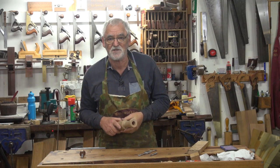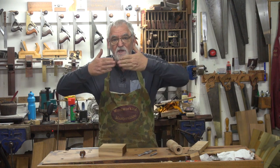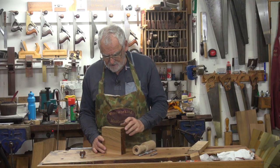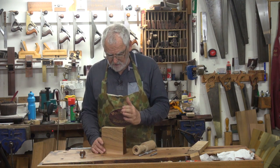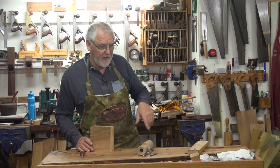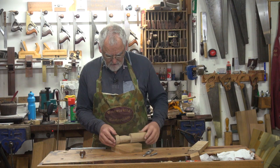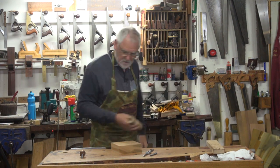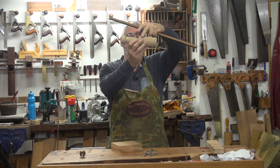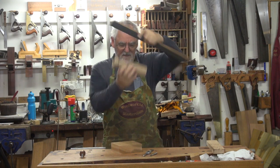It's cylindrical, so we need to make a jig. I've got an off-cut from the B boxes I make and I want to put a V-channel — 45 degrees either side — to give a 90 degree seat so the cylinder can sit in nicely. I could use a framer's guillotine or a hand saw, but the table saw is by far the quickest. There's also a slight taper on it, so that has to be addressed so it sits true to the face.